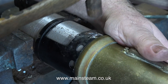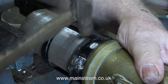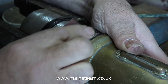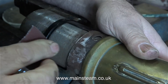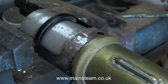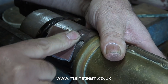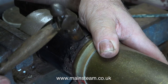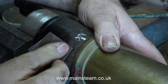The holes have gone back to round and they look okay. I'm now working my way around the firebox removing any dints. As I hammer around, the paint is getting chipped off and it's quite difficult to see which parts are level, so I'm using some emery cloth to remove the paint so I can accurately see the shape. When doing a job like this you must use very light hammer blows and plenty of them.